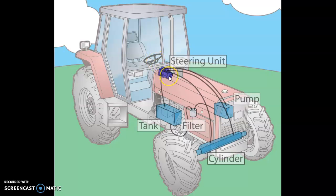They're showing a steering unit here. There are lots of different names for these in industry. Steering control valve is what I've always called it, but also hand metering unit, steering metering unit, or steering unit. It basically is our control valve for steering, and it's ultimately what the steering wheel is attached to.